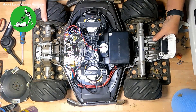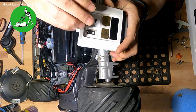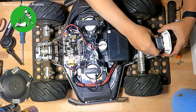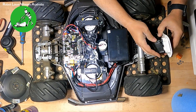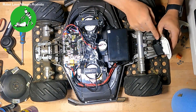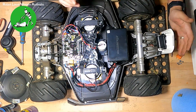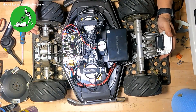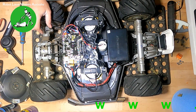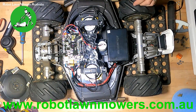As I mentioned, the main reason I've actually opened this robot up was to have a look at the SIM card slot. On the back of the Luba there is a USB port and a SIM slot, which I was very curious about. I've opened up this little section — I can't open any more because I don't want to break the seal — but I was able to take a photo in there. The SIM card adapter has no plug in it. So yes, there's a SIM card holder in there, but there's nothing feeding off the SIM card slot back into the main board, and there's also no antenna for 4G or anything like that.